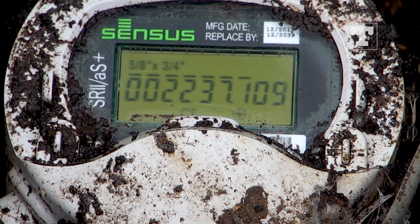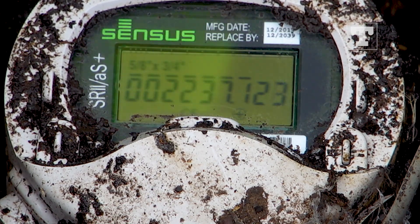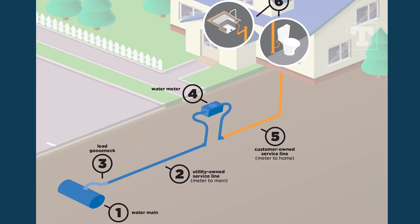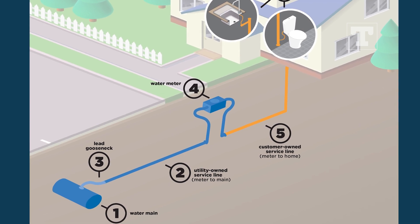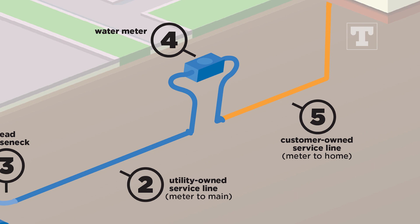After turning off the valves, check the meter dial. If the flow indicator is still showing a plus, there could be a leak outside by the whole house valve, a joint where in-yard irrigation splits off from the main supply line, or in the main service line. Addressing a water service line leak will likely require a plumber.